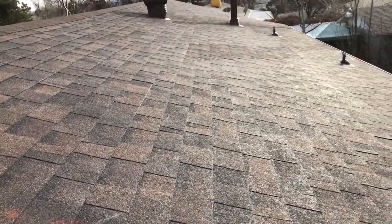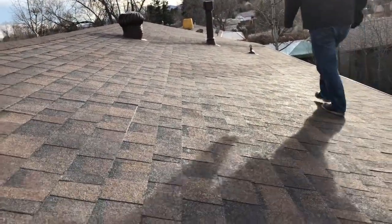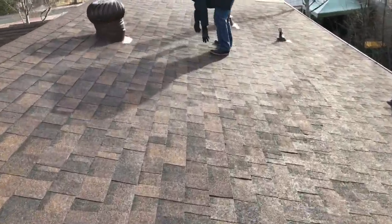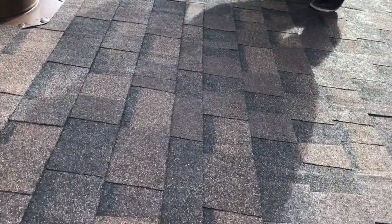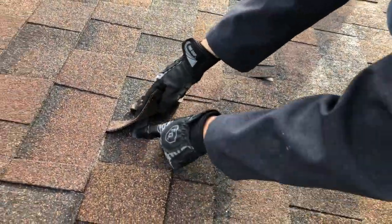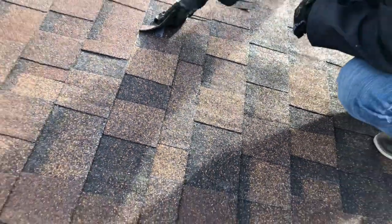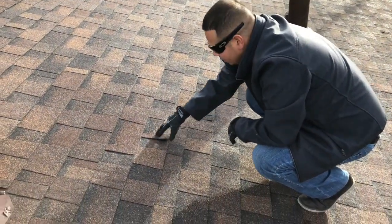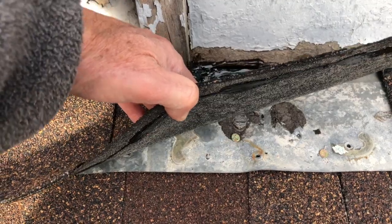Would you go over there and show them the three-inch? Oh my goodness — we've got a three-inch exposure over here. I'll lift up so you can see exactly where the nail line is. This is the nail line here, and this is where it should have been. On a roof this small and this simple, there should be absolutely no reason to have a three-inch exposure when you should have about five and a half. This is crooked as can be. This beauty course is not beautiful.